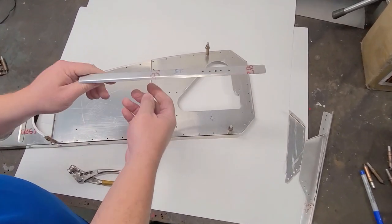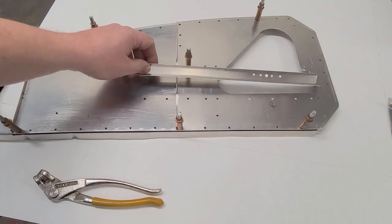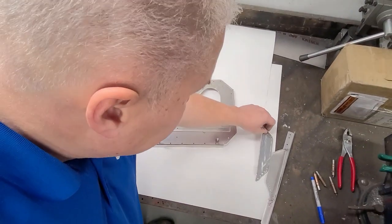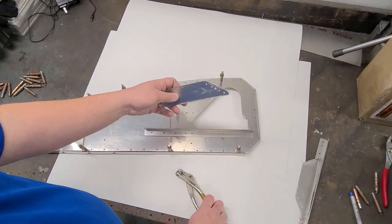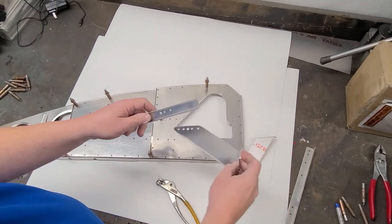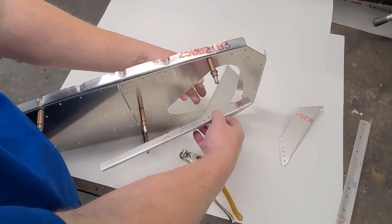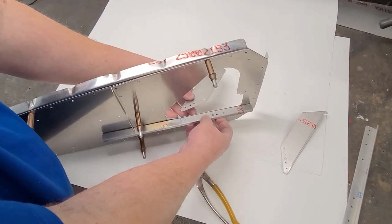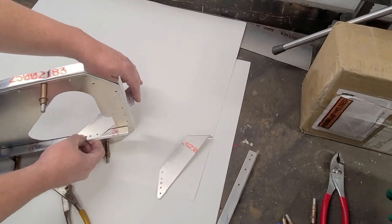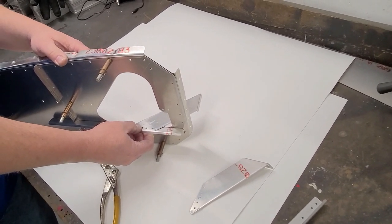The angle piece holes are already here — it mounts in there, and now you can see why the notches are there. This angle lays in that space, and then these pieces go on as well and run back to the main spar. You can visualize a rib sitting in here, with this bracket, then this bracket, attaching right here to the main spar — just like this face. There are pictures in the plans and in the manual showing how to do that.